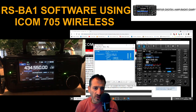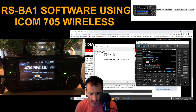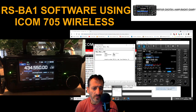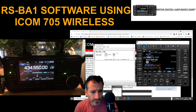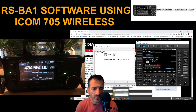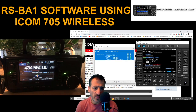This is what threw me because I've been here for ages trying to configure just one thing. You do the server first — that's the ICOM Remote Utility with the red and black square icon — you fire that up and configure it first, and then you fire up the RSBA1 Remote Control to actually control the radio. That's what threw me.